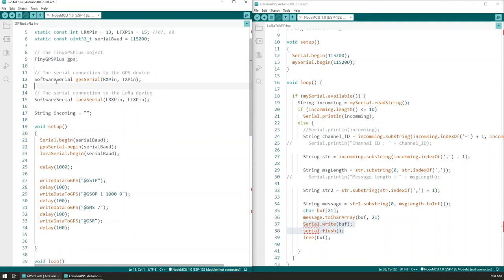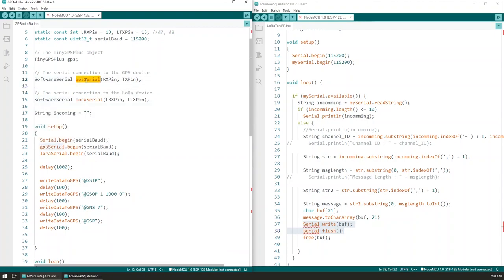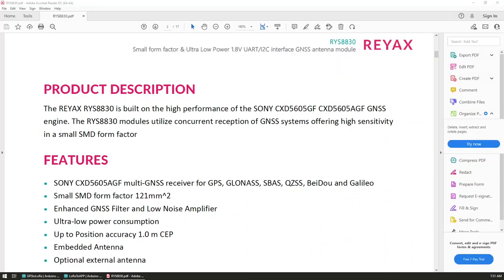On the left you can see that we set up the GPS object — I'm using the TinyGPS Plus library for decoding the GPS signal. The GPS module is connected through serial, just like the LoRa module. The most important part is the set of commands we send to initiate and set the GPS module into the right state. At the beginning we set the module to idle state, then we set the frequency of how often data should be acquired, and with the third command we tell it to use all available satellites and services.